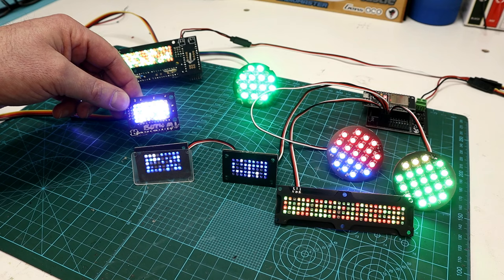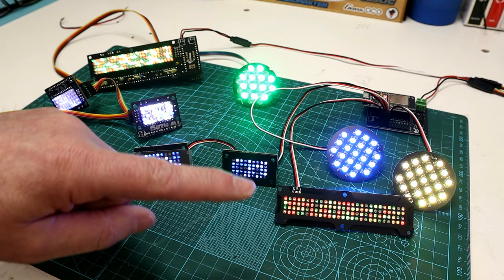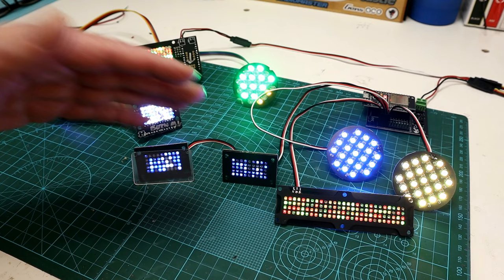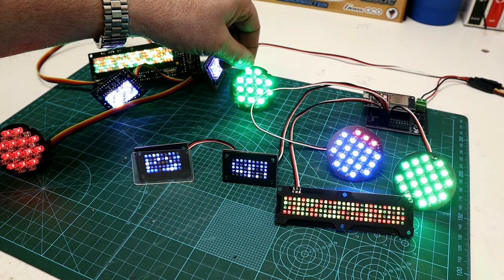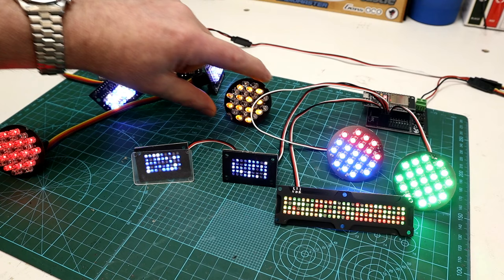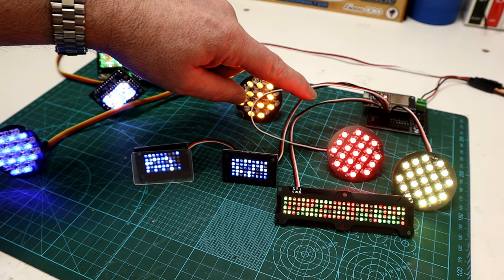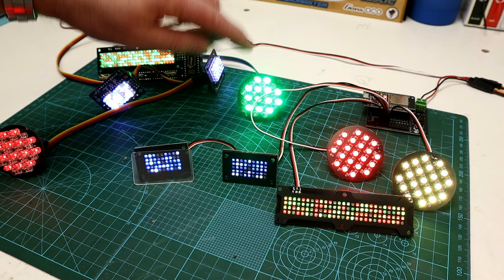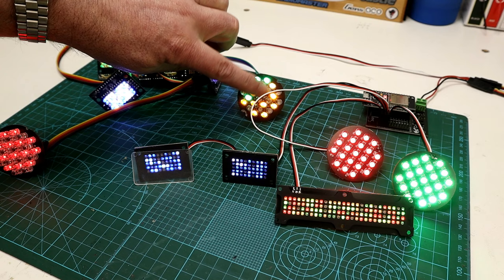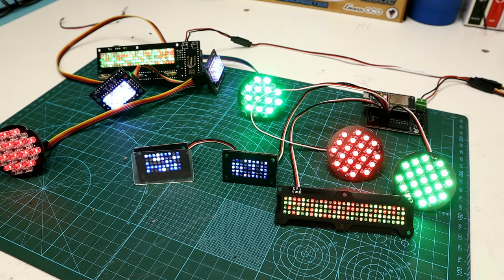My concern with driving any LED brighter is you're shortening its lifespan. There's a fairly thorough write-up on Adafruit's website on their NeoPixel page covering how they work, including lifespan — I'll link to it below. On the PSI, the AstroPixels are not quite as bright as the TC's but there are more LEDs. Because the LEDs are specific colors, only half of them are lit up at one time — either green or yellow. Whereas these can change color so all of them can be lit up. Without an extra diffuser film over these, you could see all the individual dots — some people like that look, I didn't. Both are nice light sets; get what works best for you.